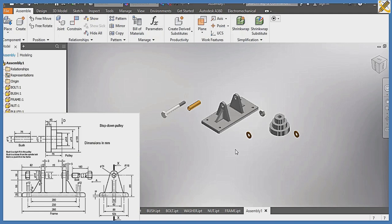And even see the length. The length of that pulley is 75, and the length of that bush is 75. So you compare the dimensions, you compare the structures, then you are going to deduce where a particular component is going to fit into. All right. So it is not magical. It is actually visible to the eyes. All right, so also look at the position of the bolt. Even in this particular problem, everything has been arranged, so you don't have any problem with this.